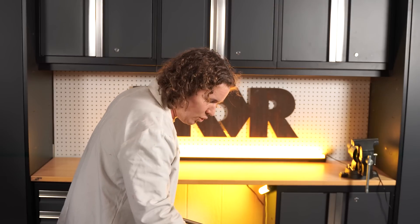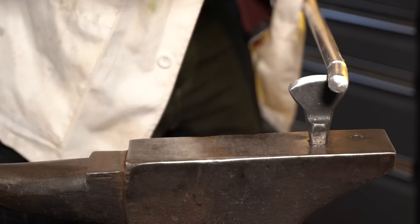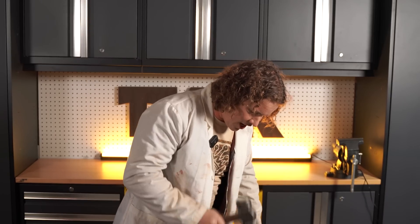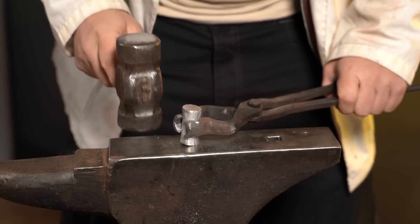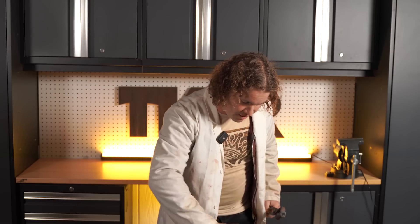It's a really fun thing if you want to take a bunch of this stuff and cast it. Since someone told Jamin about the dice, I'm going to go ahead and make it while he's eating some dinner — I'm going to make a really cool die for him. The die I want to make is actually going to be bigger than the material I'm working with, so I'm going to cut off a section and do a process called upsetting, which means the final dimension will be larger than what I started with. I'm just going to start pushing it down into itself, flipping it over to work each side evenly. As I hit the top with the hammer, it's changing its dimension, and the anvil hitting back on the bottom changes it too. If you look, it's already starting to give you an hourglass figure — we're going to smash that all the way down, then bring it out in different dimensions and make a cube.